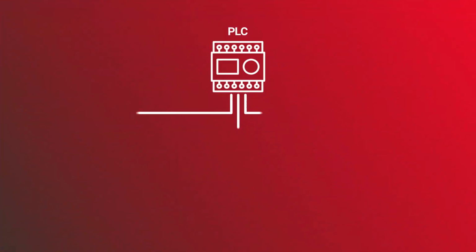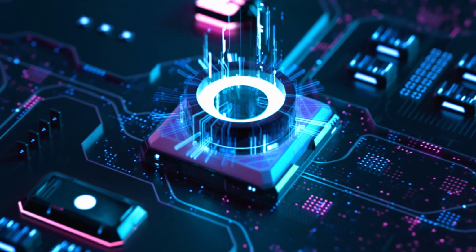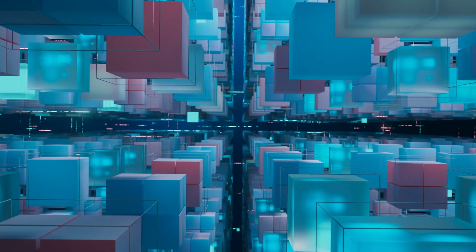To start with a brief summary, PLCs consist of three main components. The first, and possibly the most important, is the CPU. The CPU is the processing unit, just like in every computer. That's the part that actually stores the program and allows us to download and upload to a computer and store and often back up with redundant programs, and that's usually the most expensive part. If we lose the program, the entire system fails. So we gotta keep the CPU protected.